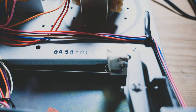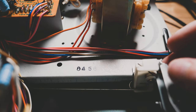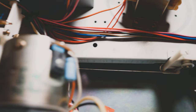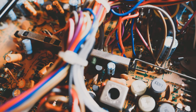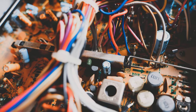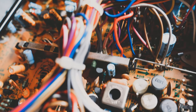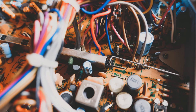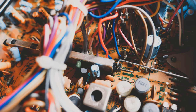I started looking into pressing that button and trying to see what mechanisms it was triggering inside the cassette player. I noticed something straight away — something had become disconnected. I'm going handheld now so apologies for any wobbliness. As you can see here, there's a plastic bit on the right-hand side. This metal arm is meant to push that plastic piece to the left. That silver cable runs across, goes underneath, and connects to a piece of plastic. That wasn't connected when I first opened up the device — it was just flailing around inside, having become disconnected at some point during moving.